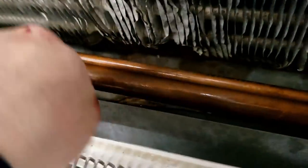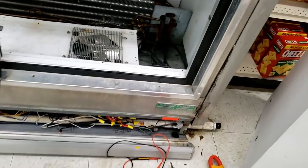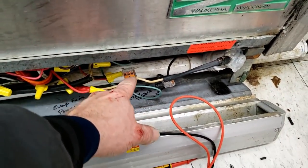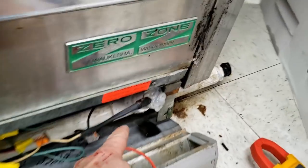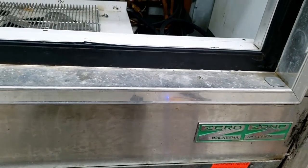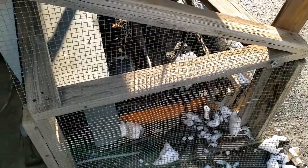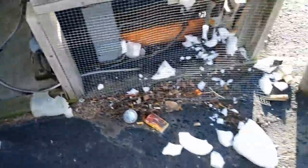Got the heat tape down the drain - it had to have made it at least over to the T. Got the strap to the bottom of the refrigerant line. It comes over and ties into our junction box, ties on with the big main heater that goes underneath the coil. Getting this thing back together and up and running. I put these little Wagos on here that I had left over from my True stuff, but unfortunately no good way to get it up there. I did add a little extension to try to keep water from overflowing, which worked fairly decent. Knocked some of the ice off, got the inside running - so far the sight glass is full but we'll see how that changes.